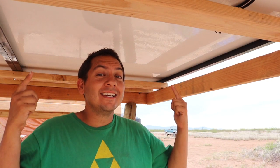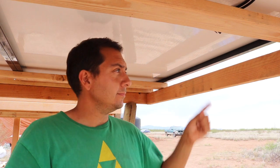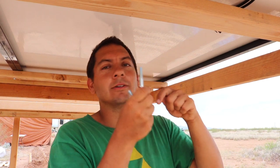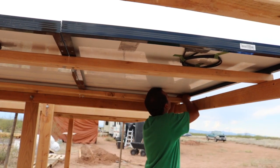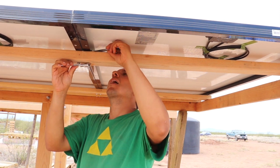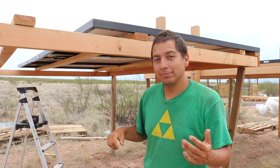I'm back here in my hideaway underneath the panels. I've been fastening these with a combination of lag screws and lag bolts. The ones near the top and bottom of the frames get a combination of screws and bolts; the ones running along the center are all bolts. I need lag screws where the 2x4s attach because I can't get a bolt all the way through there. Now that the bolts and screws are in place, I'll just tighten them down with my wrenches. After this one, I just have six more to go — easy peasy.